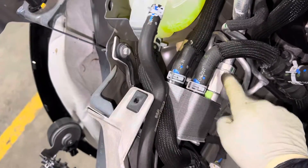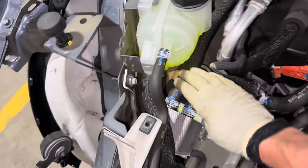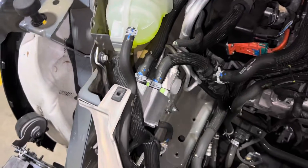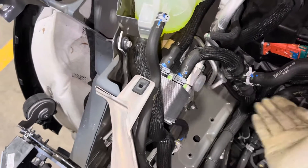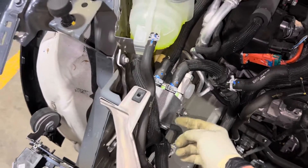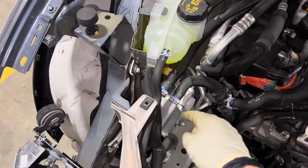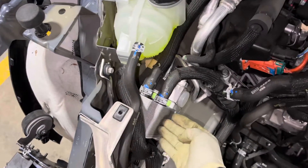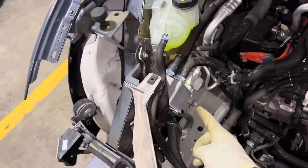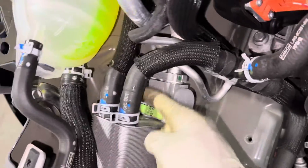There's your solenoid that cuts off the flow of refrigerant to the expansion valve. You wouldn't want the glycol cooling to be active when it's not called for — if the compressor still feeds refrigerant through, it would freeze the water, drop below temperature, possibly freeze the glycol in the plate heat exchanger and rupture it, causing a leak. That's why they have that solenoid right there.